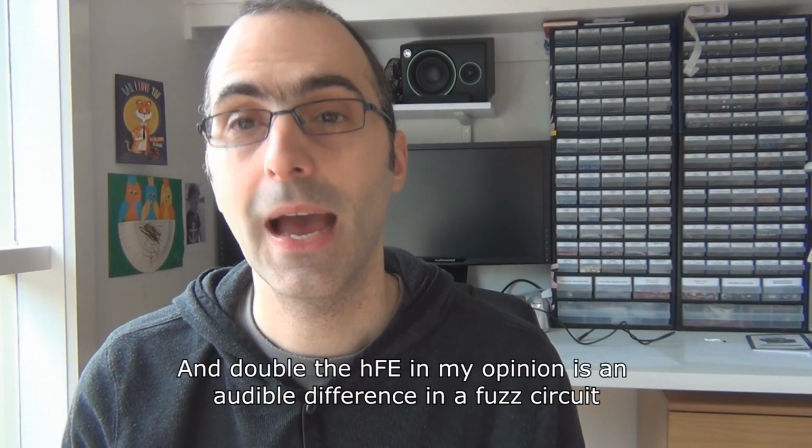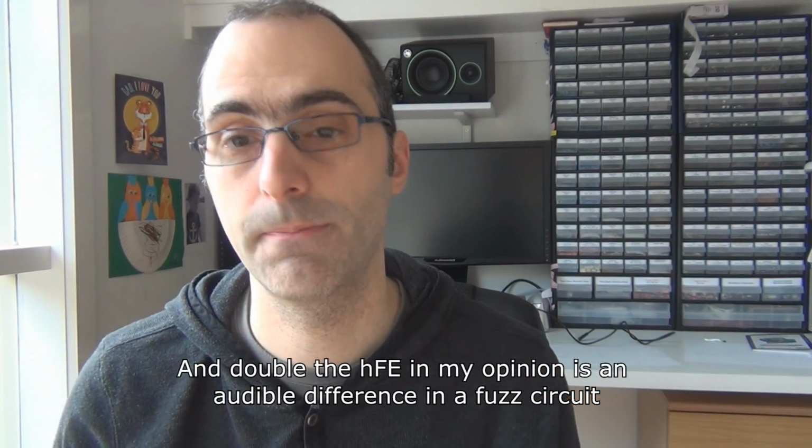So I think a more accurate way is to use the curve tracing ability on the DCA75 to check the germanium transistor HFE. I know there's a lot of people that measure germanium transistors on a DCA55, done, yep, done, and they're on eBay, just pumping out germanium transistors, testing one after another. Oh, I bought them for 30 cents, I'll charge $1. But I don't know if it's that accurate. And I can tell you with specific transistors, the difference is double. You get double the HFE off the quick test that you do with a simulated Small Bear test.